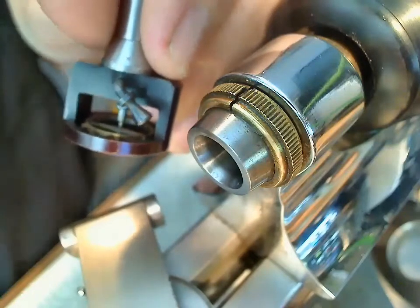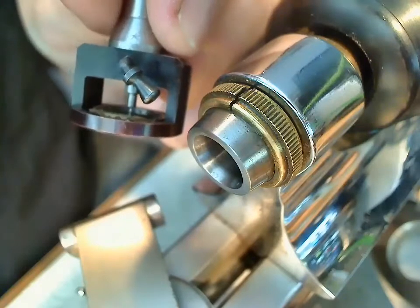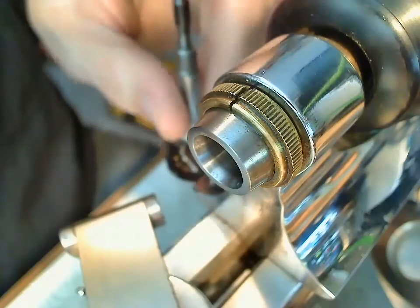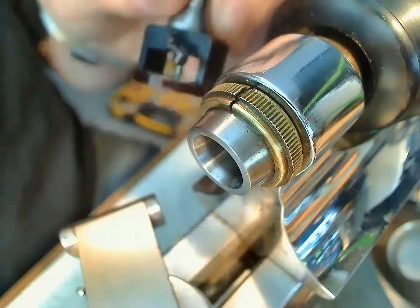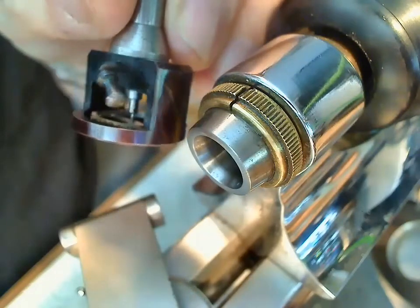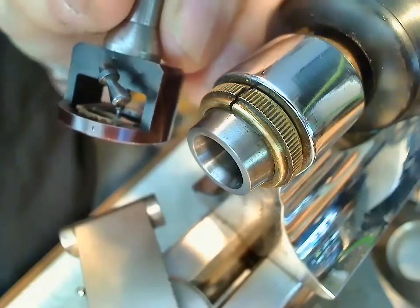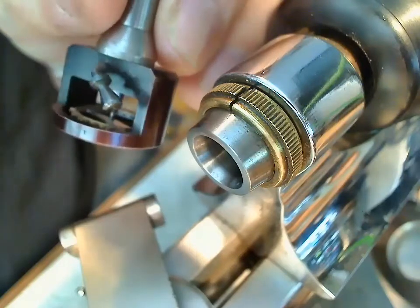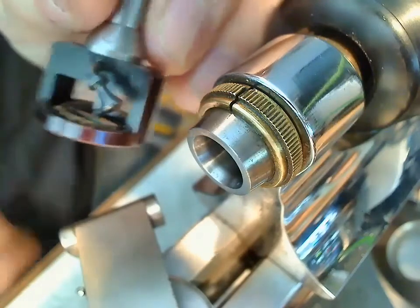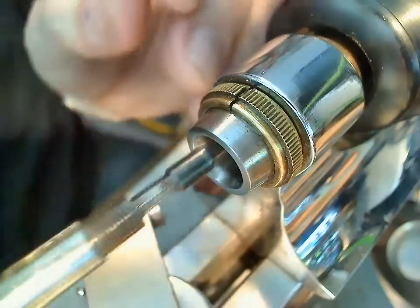So the best way of doing this was to throw the balance inside. Use a piece of Rodico to align it with the hole. Use the top of your finger to push down, and there's a little mini spring here to push down on it until you've got the other end of the pivot inside there, and then make sure it's tight. Now this is going to be spinning, so you have to make sure that the balance is fairly tight in position, so the balance staff stays in place. So as you burnish it, it's not rotating inside.